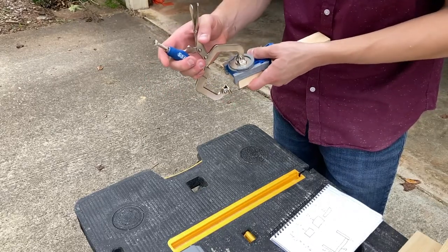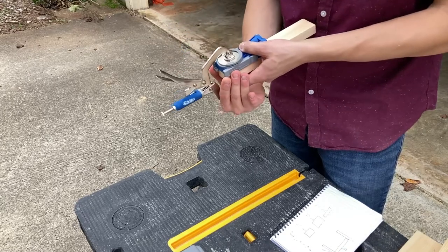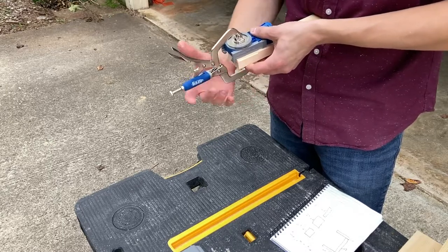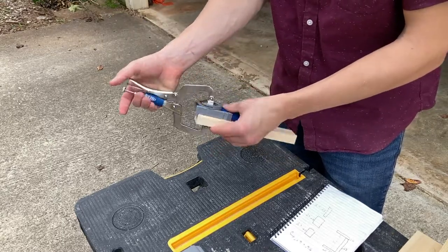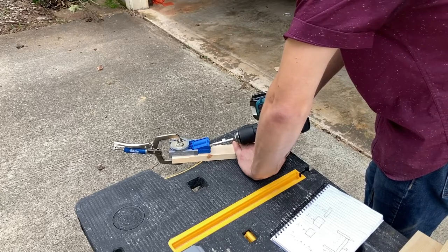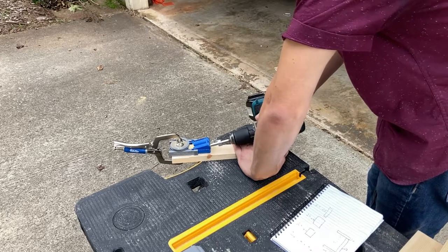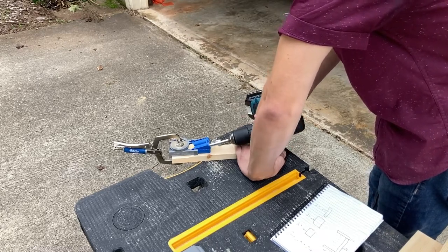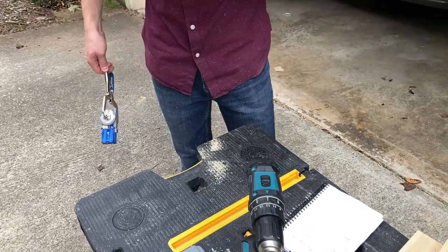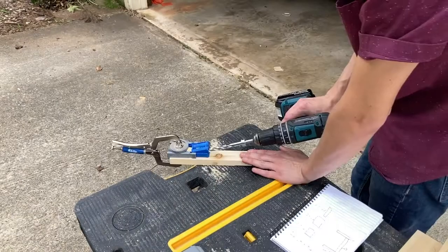This is the pocket hole jig. There's a dedicated clamp—this is by Kreg, K-R-E-G—that goes into place, and then has a special drill bit that you put through the jig. These should really be clamped to a table, but since I was drilling so many of these making two shelves, it was just faster to hold it down by hand and carefully move it over. It pops right off—this creates a lot of sawdust so it's good to do outside. You can see how that works: a screw will slide right in there.